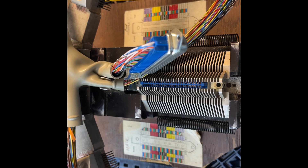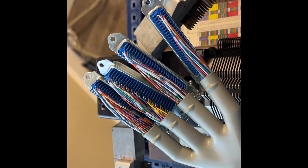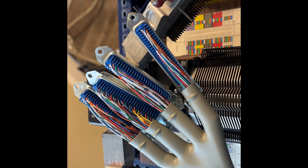I have another one in the machine to do the next binder group. I have all four of the connectors put on the end of the 100-pair. Next thing is to put the hoods on and the screws.